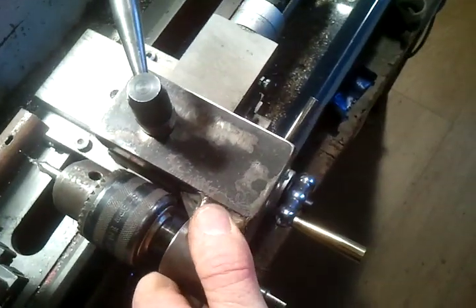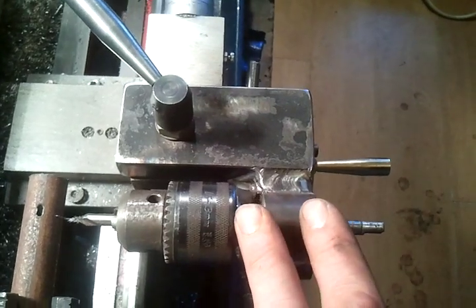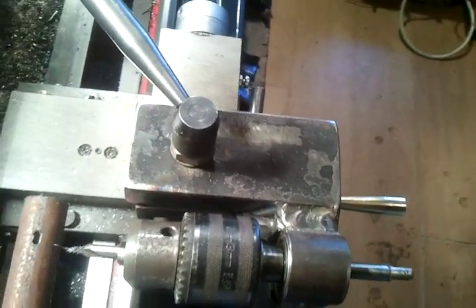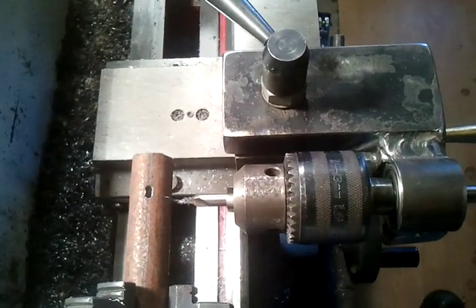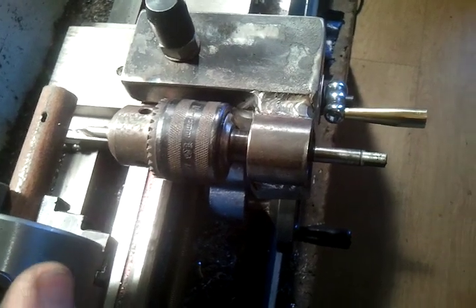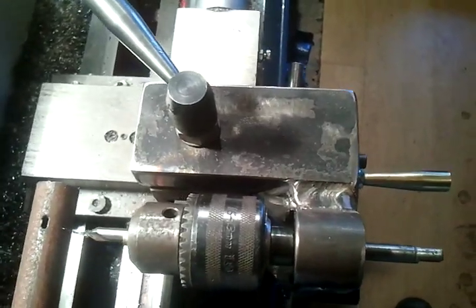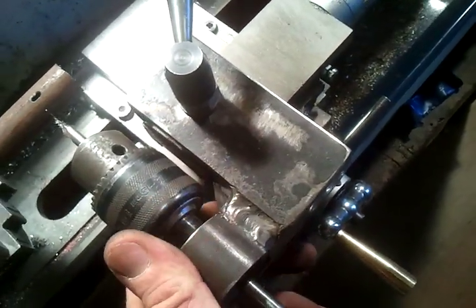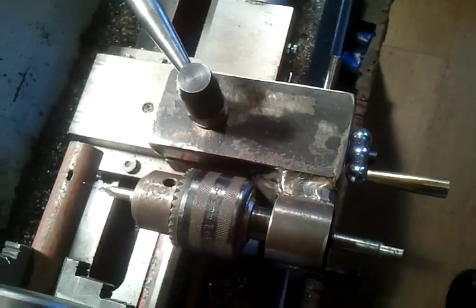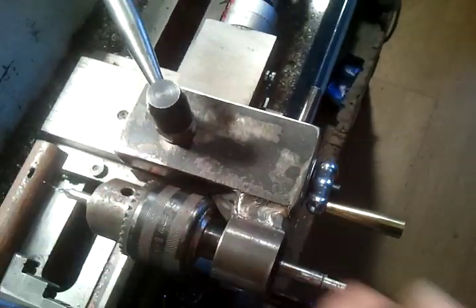I'd never bored out steel on this lathe until yesterday. I have a boring bar and I'd done it a little bit on brass, but only once or twice messing around — never any precision work. So yesterday I thought right, get the boring bar set up nice and short inside the tool post, just long enough to do the work, all nice and square. I started to bore out the centre of the pipe and managed to get it bored out perfect. The bearings fit in nice and snug — a hammer fit, but not crazy tight. Just gentle taps with a bit of wood and a hammer and they go in nicely.